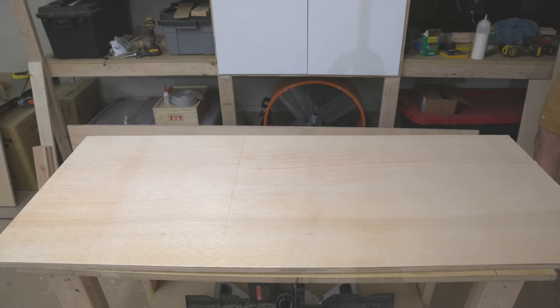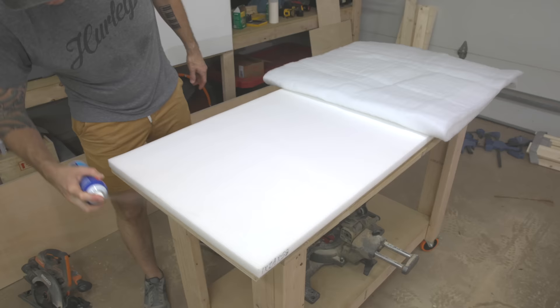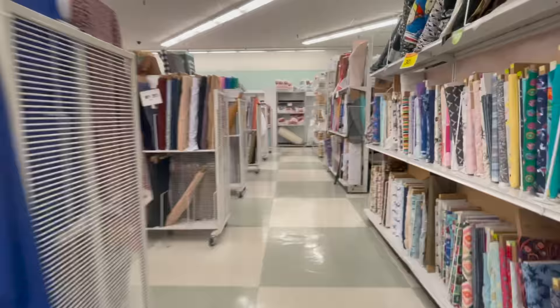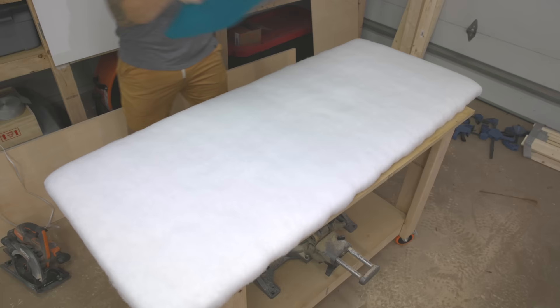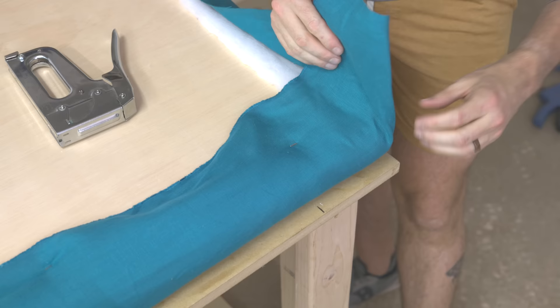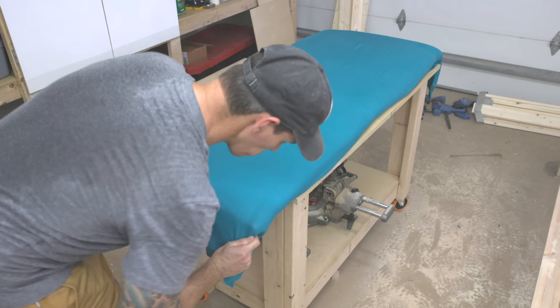Now I'm working on the headboard, which I'm making out of 3/4-inch plywood and 1-inch foam. I cut the plywood to 24 by 58 inches — the same size as the foam I ordered online. The foam attaches to the plywood with spray adhesive; allow both sides to dry and then stick them together for a permanent bond. I covered the foam with batting material and used half-inch staples to attach it to the back of the headboard. I ran up to Joann's and settled on a turquoise linen, buying two yards. I ran a steamer over everything to remove wrinkles, and by taking your time and working section by section you can get a nice clean-looking headboard.